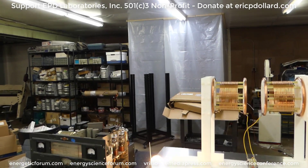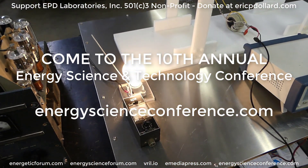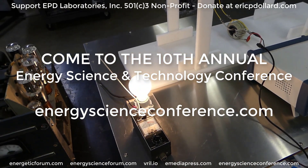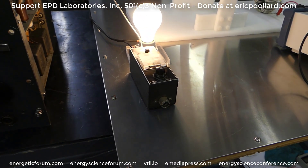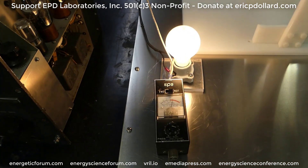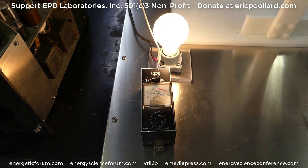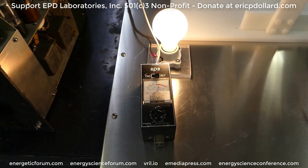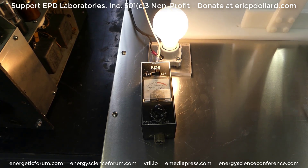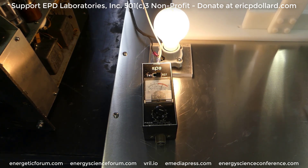Let's get the camera locked into place here — bring it down a little bit, get it closer. Okay, we'll lock that into place. Do you want to explain what the meter is doing? This is the beat frequency. The whole idea is to find out where on the transmitter it's going to be the same frequency as these coils. It looks like we're lucky — we've got it almost down to zero beat.